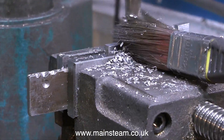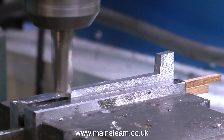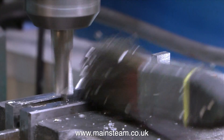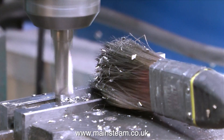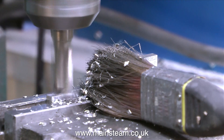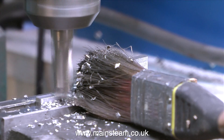And here's how I made the key. I put a piece of steel in the machine vise on the milling machine. This piece of steel I roughly cut from a piece of angle that I found. You will notice that during this milling process, I'm occasionally holding a paintbrush close to the milling cutter — that's to stop the chips flying off and burning my hand. It's a good idea to have a brush near the milling machine at all times, but preferably a brush with proper bristles. This one has synthetic bristles and the heat of the chips is making them stick to the bristles, which is not good — but it's still better than getting frequent burns from the chips landing on the back of my hand.